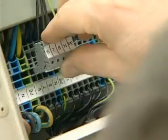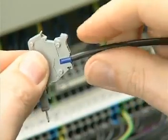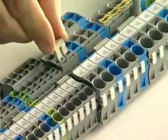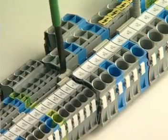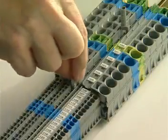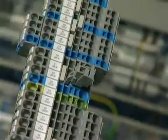The jumper slots can also be used for pre-harnessed plugs for the connection of sub-assemblies. The spring-loaded jumper system also allows the connection of two adjacent terminal blocks of different cross-sections using a standard jumper. This way, it is possible to jump over up to 2 cross-section sizes. Special step-down jumpers can be used for even greater leaps. All terminal blocks, including the PE terminal blocks, can be jumpered in both directions.